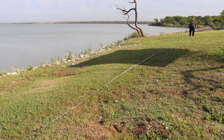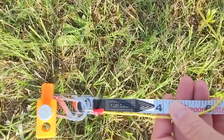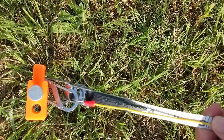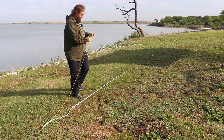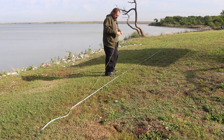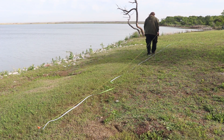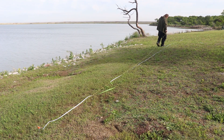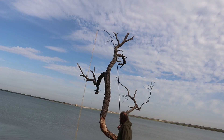I've got the antenna wire hooked on — it's almost perfect right at the starting point of the tape measure. Now we're going to walk out the length. The first length we need is 25 feet 9 inches. I ended up at 27 feet, so I cut it way too long. Oh well — better too long than too short.